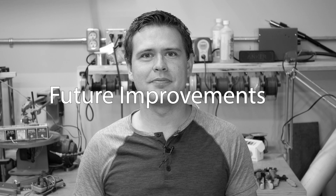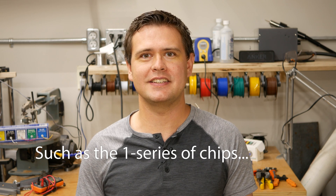I'm really happy with how this project turned out — I feel it's objectively better than most lights you could buy on Amazon or at the pet store. That said, there's always room for improvement. The one big change I'd make is to use the newest ATtiny series: it's more power efficient and the newer chips actually have 6 PWM pins, which would have saved me some trouble. I got a little too conservative going with the ATtiny84. Another interesting experiment would be to completely remove or massively lower the values on the resistors going to the LEDs, hoping to lose less power across the resistors themselves.